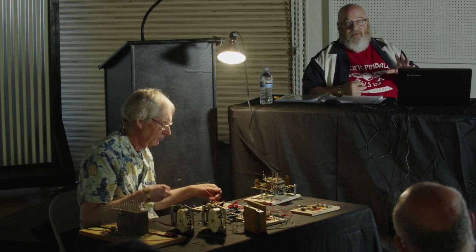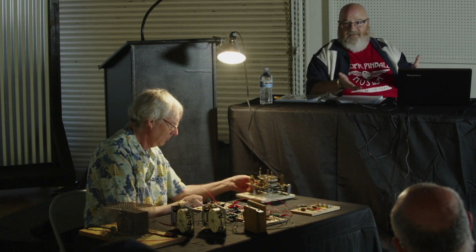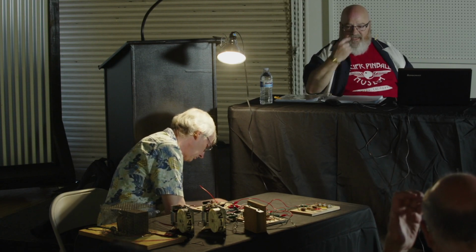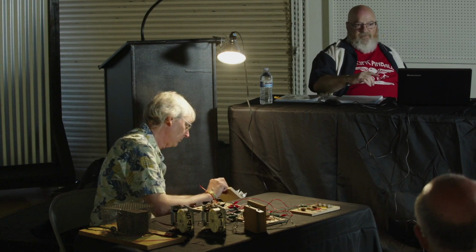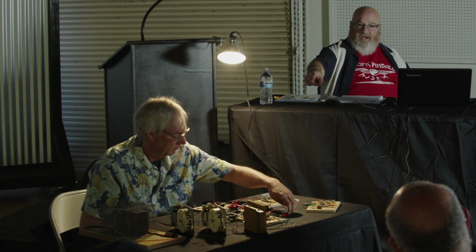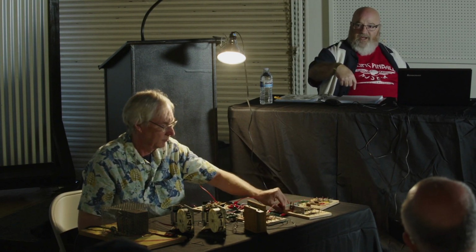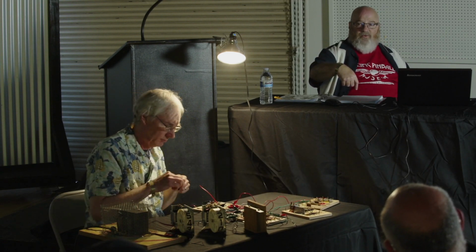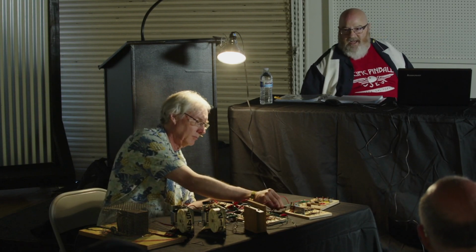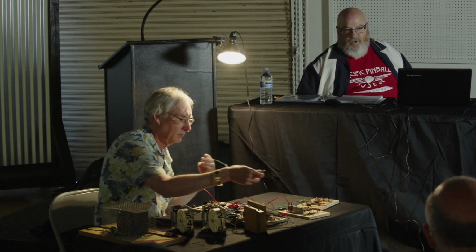You wouldn't have to have a chime associated with 10,000 because you've got the 1,000 chime going off already. So in that situation, the switch goes straight to the reel like we did, and we're not worried about the end of stroke of that reel. We already have an end of stroke keeping the circuit on from the other reel. We're not worried about a chime. It's just not necessary to have a relay for that last one.